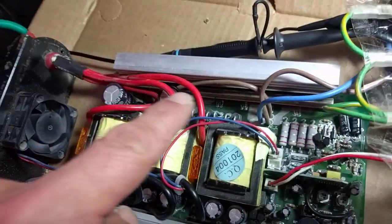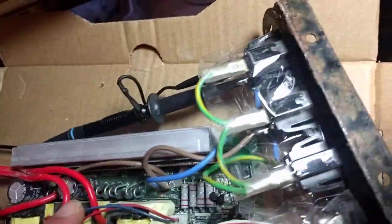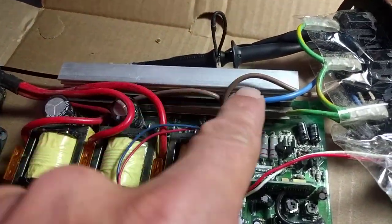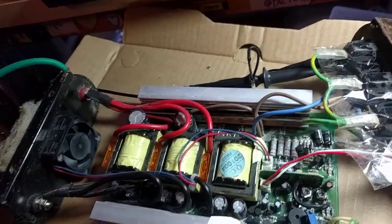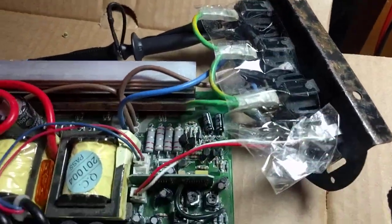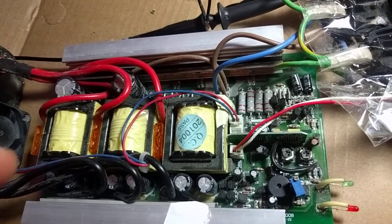These are rated at 200 volts, so there's somewhere under 200 volts DC here. How do we get from that to AC? That's what the second phase is for. These transistors along the back here are the high side chopping set — basically they take the DC and produce that waveform you saw, which is a kind of stair-step chopping AC signal. This is an H-bridge, and it's wired straight out to the sockets. It's a fairly standard design.